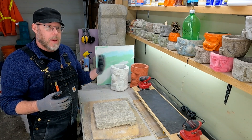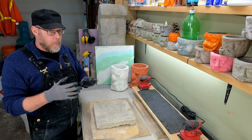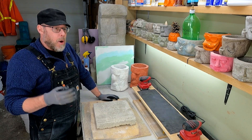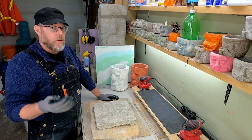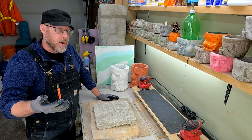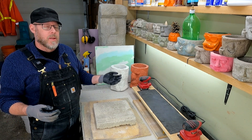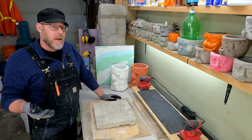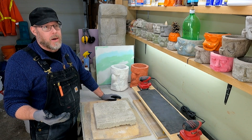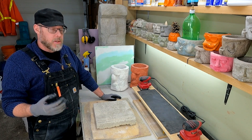The problem is that the amount of weight you reduce is not proportional to the strength loss of pretty much every lightweight concrete. So the end result is that a properly designed, full-strength, full-weight mix at the appropriate thickness for adequate strength is more often than not the answer. It's a full-strength mix, properly designed without excess — and there's a lot you can do with thinner concrete applications over steel armatures.